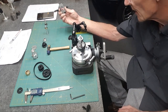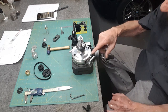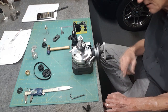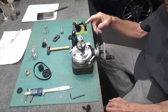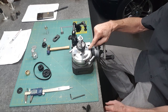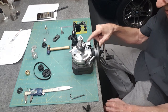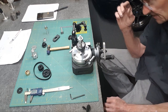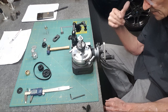I'm going to use just one T-nut on the front to clamp it down. Four holes drilled — there's not really enough room to countersink them, but everything came out nice and dead center. I already took the test indicator off. I got it within one thou, which isn't easy with these two screws loose trying to bang it around. I tighten those up and use these three barely snugged, then use a hammer to tap it around. Since it took that much to get it straight, I'm not taking it apart — it can't go back in the drawer.